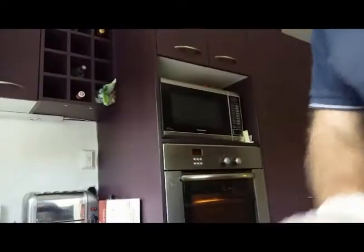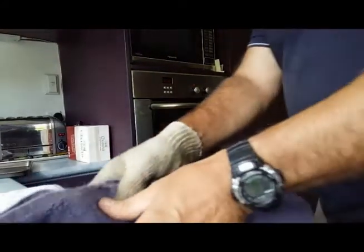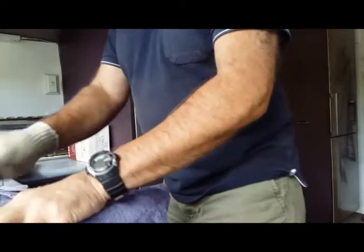And the first temper cycle will be in the house oven, but I do this one at 200 degrees. And I know that that brings the blades out around the 61 mark, so that's okay. So even if it gives me a bit of leeway then, especially because the first cycle is 2 hours, they're going to go into there for 2 hours. Let's just set you up. There we go. So they're going to go into there at 200 degrees for 2 hours.